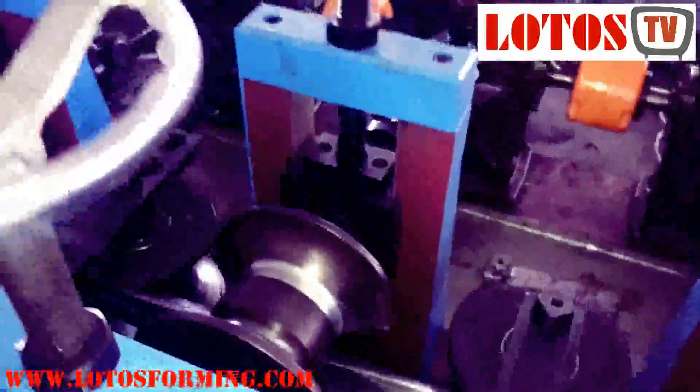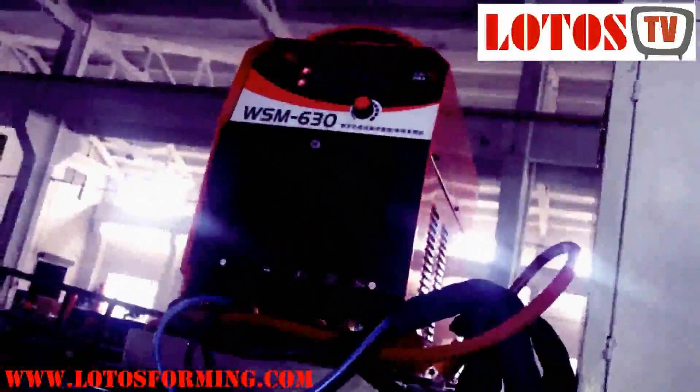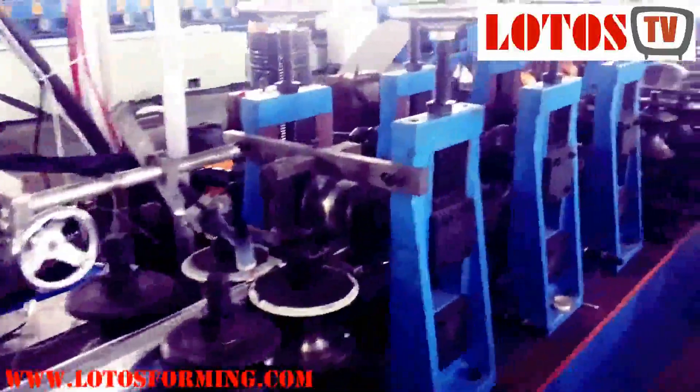After reaching this roller, the two sheets begin to clamp. After the fifth station — here are stations six and seven — the gap becomes smaller and the sheets come together. Exactly here is the welding area. This is the welding gun, and the power is controlled by the 638 control cabinet. The machine rollers are custom-made.